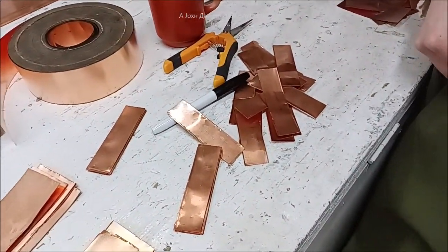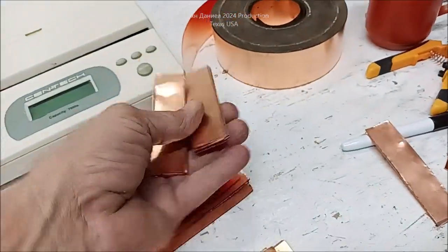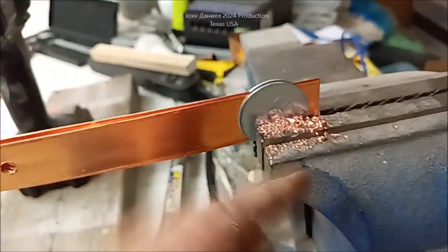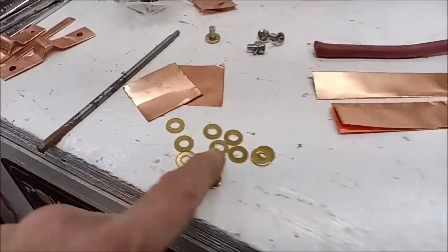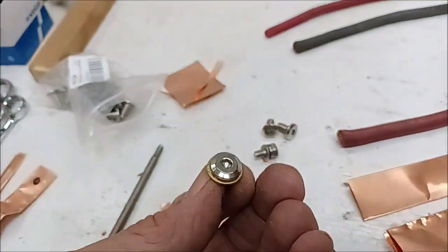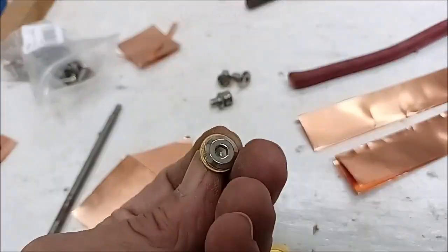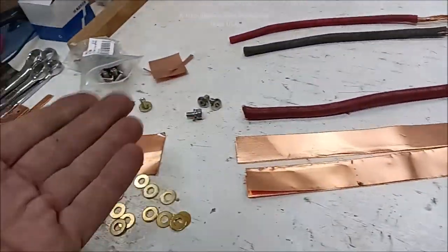As Kira continually makes these, there are two pre-made ones that will be drilled out. The way I drill them is with the washer - I just clamp it and shoot straight through, which makes a nice clean hole; otherwise you get pretty gnarly results on thin copper. We'll use washers and an M6 bolt, also copper, to compress them down.